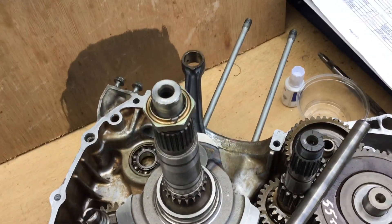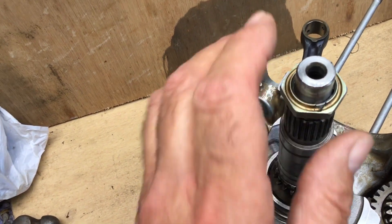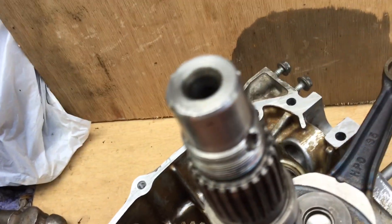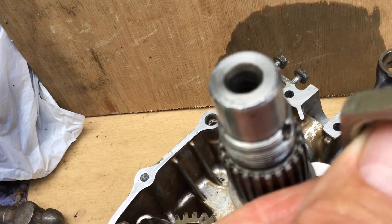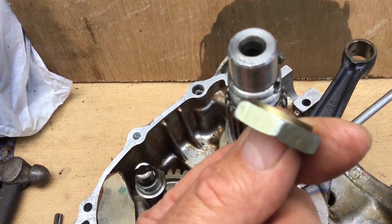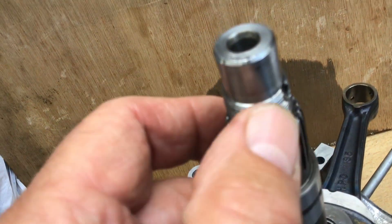This is fairly common — there's a stake. They deliberately damage the nut, a soft area on the nut, so that it can be collapsed into that section on the end of the crankshaft, into that cut-out there. When the nut's fully fitted, you collapse that ring in and lock the nut. The problem is, when you come to undo it, it often damages the threads in that area around that section. And so these threads were damaged.